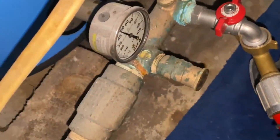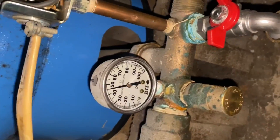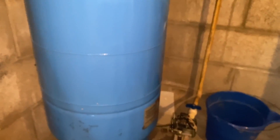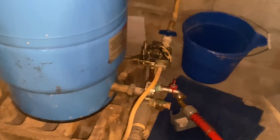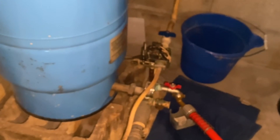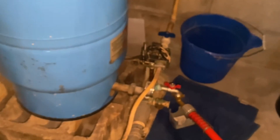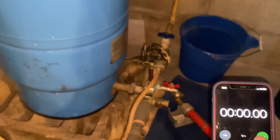To check the cycle length, we're going to let the tank fill all the way back up to 60 psi — it takes a few seconds, but not too bad. Once it gets up to 60 psi, we'll go ahead and drain the whole thing again until we hear the cut-on of the switch. We're getting the stopwatch ready for the pressure switch to engage, and once we hear that click we'll go ahead and turn off the shutoff valve.